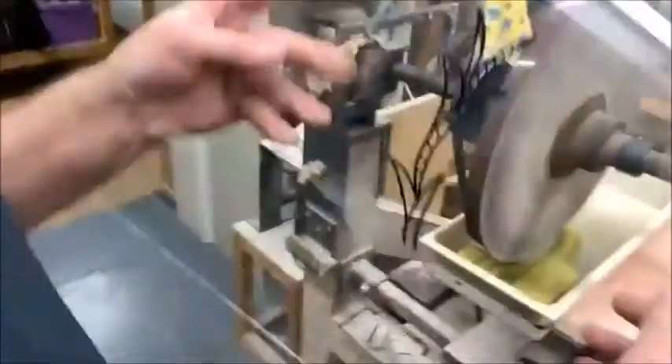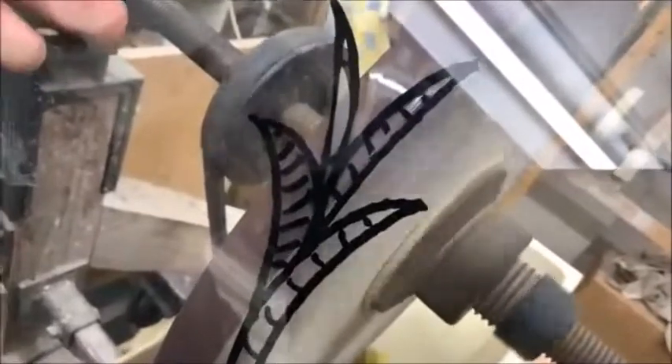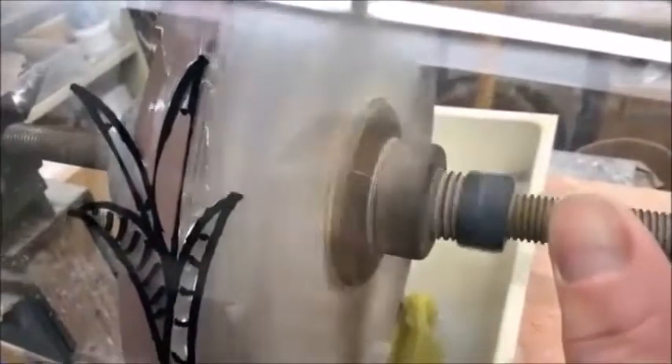This is a piece of just ordinary four mil glass — it holds up pretty well, it's like a paint actually. I'm going to do one cut, starting at the edge here. It makes a bit of a noise. I'm working at a slightly awkward angle. The wheel's running at just under 320 RPM, probably a little bit less actually. I'm not going to go too deep — you can see where it's cutting, where the actual wheel's making the cut, getting slightly larger.